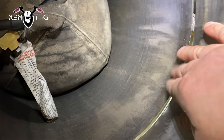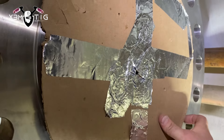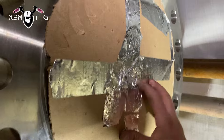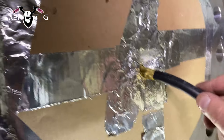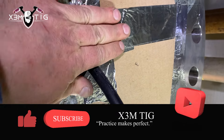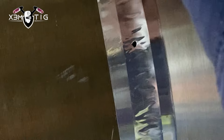Now it's acceptable — maybe up to one mil — that should be alright. Now I'm going to close this end with cardboard, tape it around, and drill one hole in the middle. Make sure it's nice and closed with no air gaps. I insert the purge hose — I go with one purge hose because it's only a flange joint, and I put that balloon 10 inches in. If it's a 90 further from the purging zone, I'd go two or even three purge hoses on a 12-inch pipe. I put vent holes on top and go with aluminum tape all the way around.